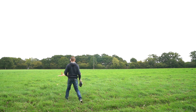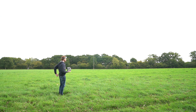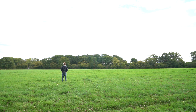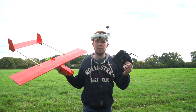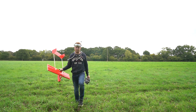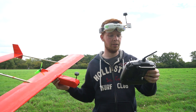Time for the flight test. I have FPV goggles which show a live video feed from the plane, and on that feed I can read off the battery voltage. My plan was to fly the plane with each battery and land once the battery reaches 14.8 volts at cruise speed. I'll skip quite a few bits because it gets quite boring. The results: the lithium polymer battery gave 41.5 minutes of flight, and the lithium-ion battery gave 36.5 minutes — which was actually less than the lithium polymer battery.